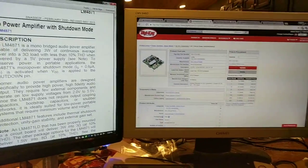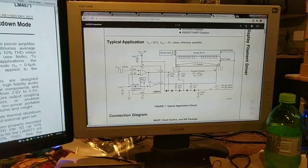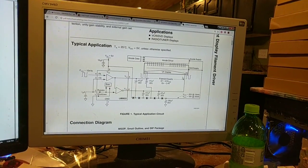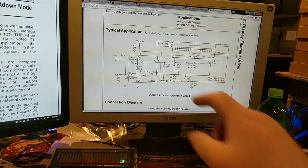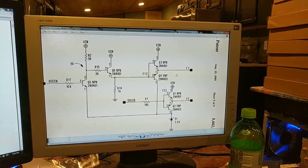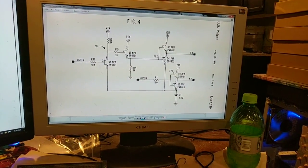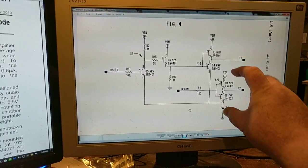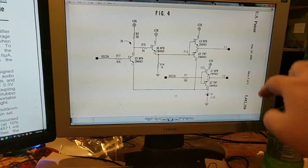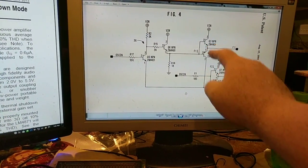So the reason why I need this circuit, as I mentioned before, is that the filament supply needs to be AC so that you don't have fade across the display. And plus, having an AC signal gives me the ability to do a step up. Here's another design of one. This is actually from an old patent that's now expired, but this gives a rough idea of how the circuit would work. All this is just a dual push-pull transistor array. So if you look at it from a modern perspective, if you take this guy, move it over here, and then flip it around 180 degrees, you technically have an H bridge between the filament. This does an inversion process that turns this one high when this one's low, and then this one low when that one's high.